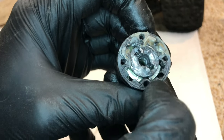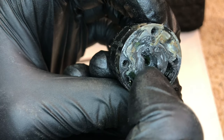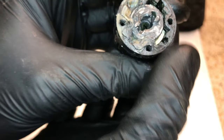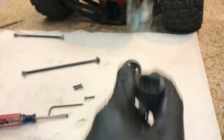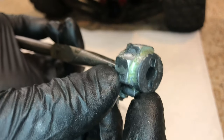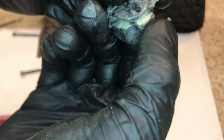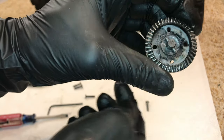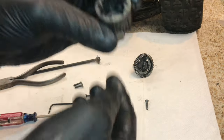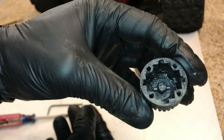Here's this side - definitely something's happened here. There's definitely something going on where it's begun to wallow this out. You can see the pin has kind of elongated this, and it looks like it started to lift that up. Let's try to get the spool out. It came out that easily. It definitely started to undercut underneath of there and raised the lip up on both sides. The pin right there - that one's not broken. And this one is not broken. So, interesting - that's what I figured. I figured one of the pins would be broken, but neither of the pins is broken.